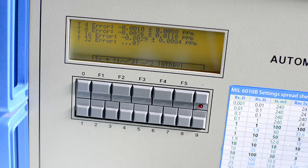down to single digit ppb. So that's how, at the top of the metrology in the national measurement institutes like PTB, LNE, NIST, and NPL, they determine the value of working standards, like the SR104, for example, for 10 kilo-ohm or 1 ohm resistance standards in the oil baths, which they further compare to all the working standards and customer devices and other labs' intercomparison standards using the traditional bridges like this 6010 from Measurements International. So that's a little bit of how it's done on the top level.